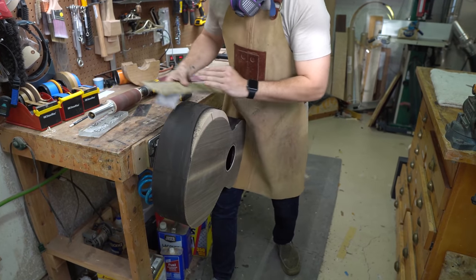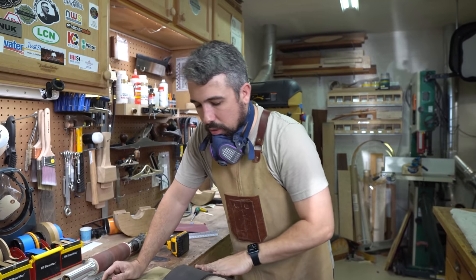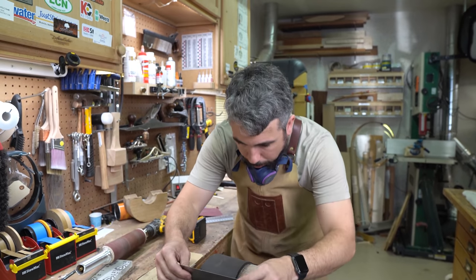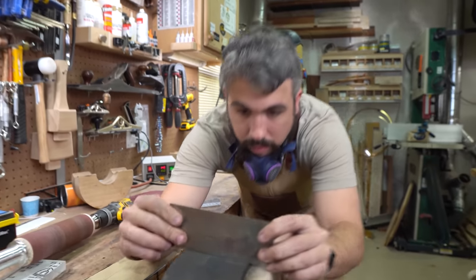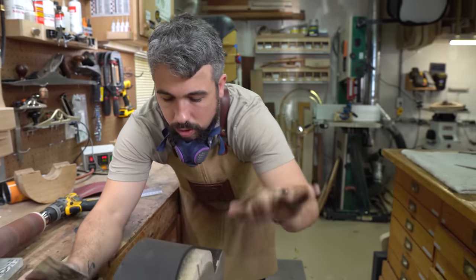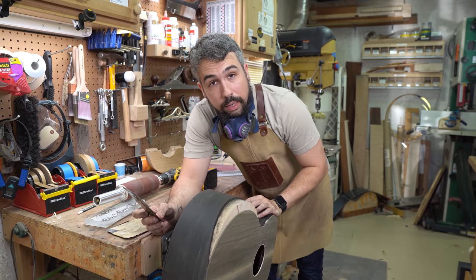You can see how quickly that's going. It depends on the wood you're using — maples sand pretty quickly, ebony is a little hard, but you can see how good it looks. This does not work quite as well as the spindle sander does at getting that perfectly straight edge. That's what you're looking for — no gap, nice and flat. So we're going to get some dust collection set up and do some B-roll, because it's getting dusty in here and my boogers are turning black.